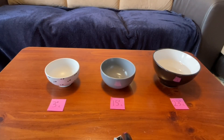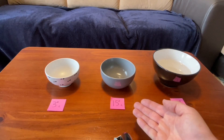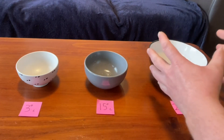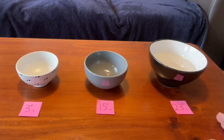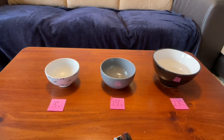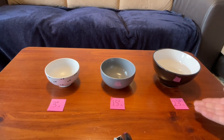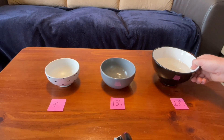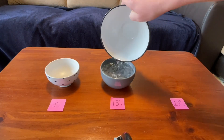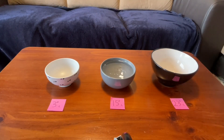So why are we doing all this? Because we hate condensation and mould — but what causes it? When the air is warm it can hold more water, but as the temperature cools off, that same amount of air isn't capable of holding as much moisture. I've got three bowls, each representing how much moisture the air can hold at a given temperature. When the bowl is full, that's 100% humidity. At the moment we're sitting at 50% humidity in a nice warm room. Let's slightly decrease the temperature down to 15 degrees — and all of a sudden we're sitting at about 90% humidity.